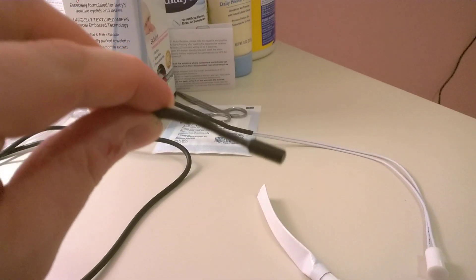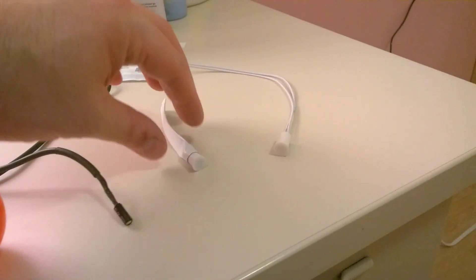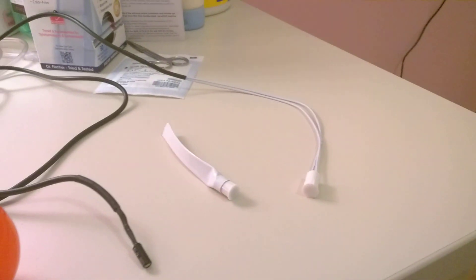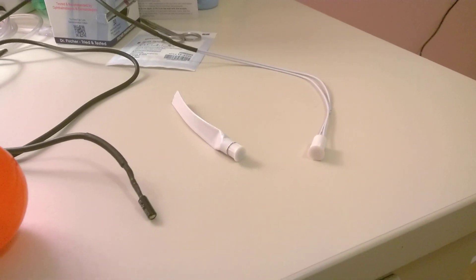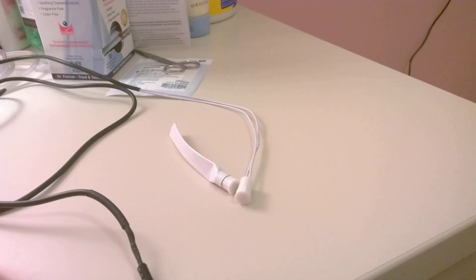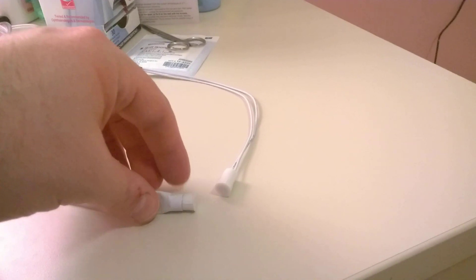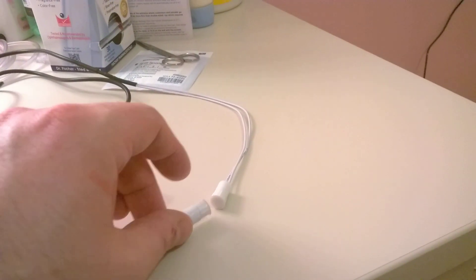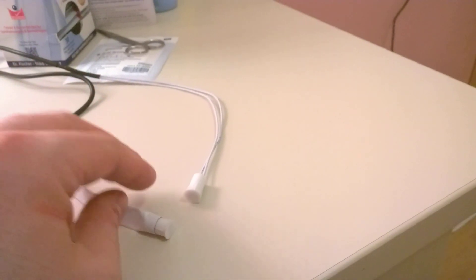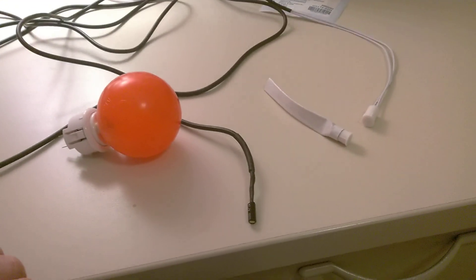I've tested all of these and they work just fine — even this next one, which I was a little dubious about. I've got some tape on it so I don't lose the small piece. This is a magnetic switch meant for activating a light when you close a cupboard door or something. The reviews on Amazon said it was normally open even though the description said normally closed, and normally open is what I wanted. When you touch the two pieces together the switch activates and the button gets pressed. I can embed this switch inside a toy or make a little pedestal for it.